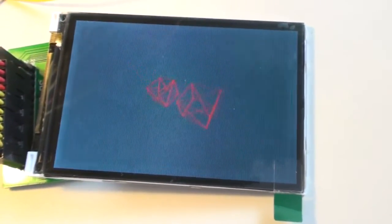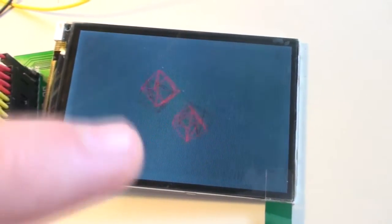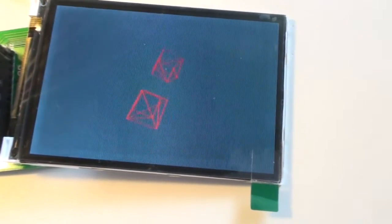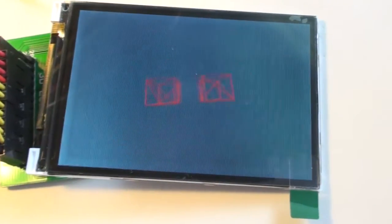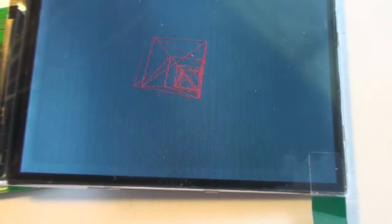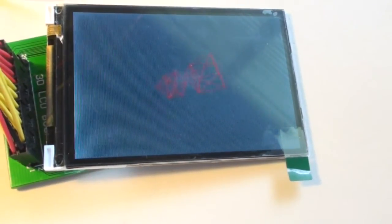It's difficult to show you the real 3D since the boxes are actually coming out of the display, especially when rotating — one box is in front of the other. But if I change the viewing angle, you'll notice it looks like there are four boxes — two boxes on top of each other, a total of four. If I move to the left eye view, you'd see only one set, or the same for the right eye. This is also because the parallax barrier has a limited viewing angle — you have to be positioned correctly in front of it. If you move too far to the left, your eyes get switched, which means the 3D goes into the display instead of out, which is very uncomfortable.